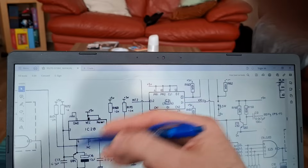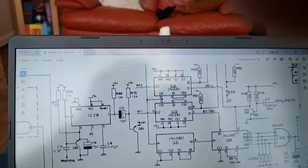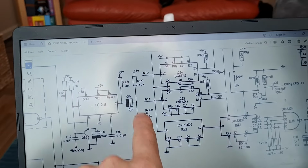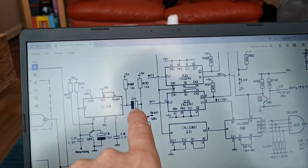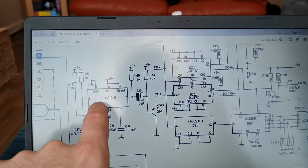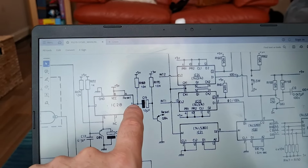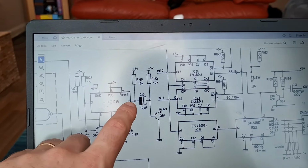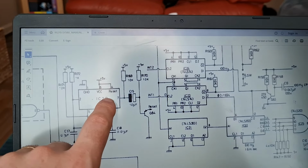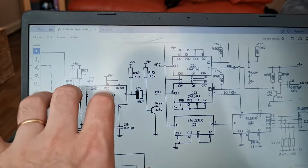So basically, you're resetting this timer over and over and over again. And this pin 7 here is being held, so this is always being held high. Now, say it times out. It times out and this goes low. Well, what's then going to happen is, if you know your electronics, pins can sink voltage as well as send it out. Sink current as well as send it out.